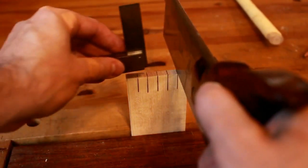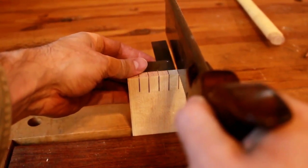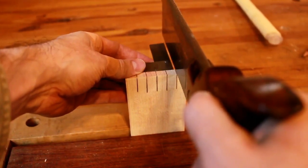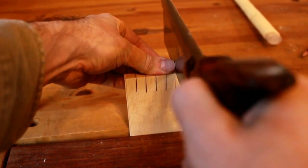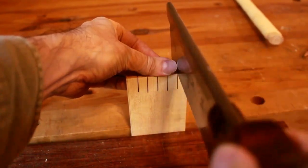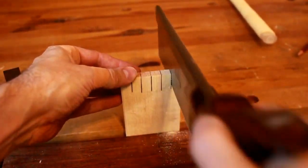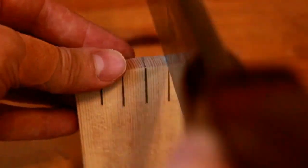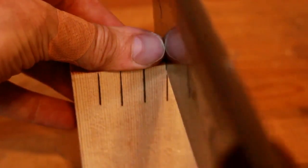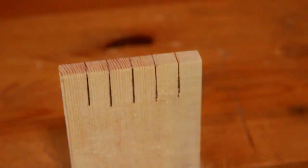In terms of the finer points of cutting, you want to make sure that your saw is at a 90-degree angle with the top of the board and also lengthwise, so that it's square on all sides when you're cutting. You maintain this angle by putting your thumb against the blade and keeping it there to register the blade as you cut. Use full strokes after you start cutting — that will help maintain the straightness of the cut. Let the saw do the work for you; don't push too hard, just glide it and let the teeth cut in.